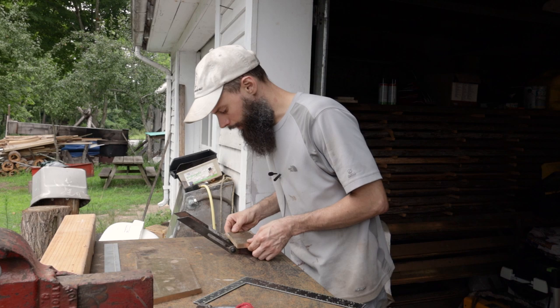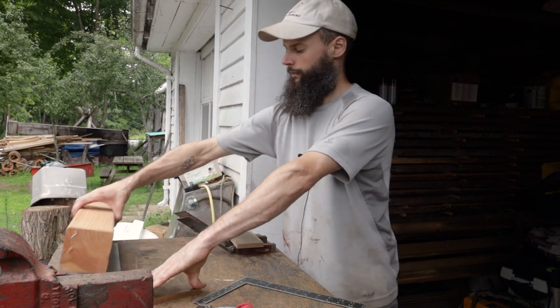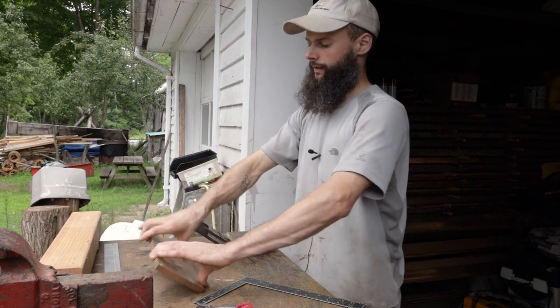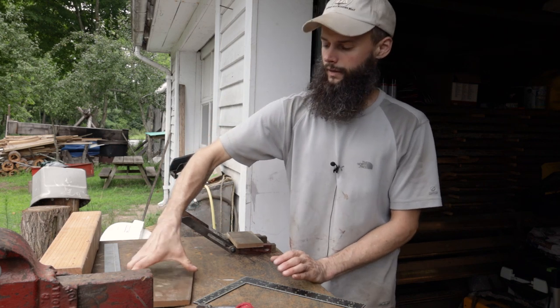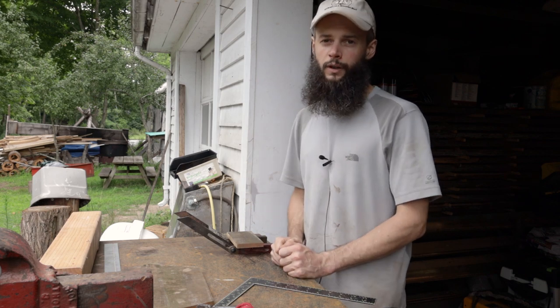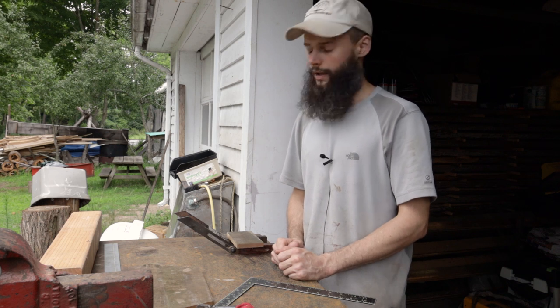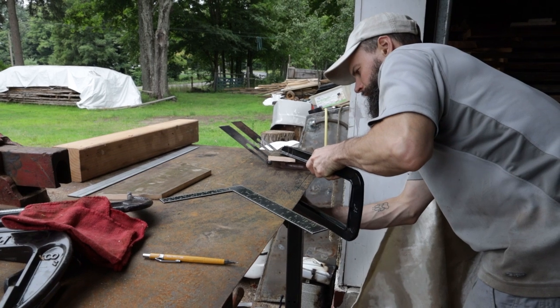You're going to get the base plate set on here and get this clamped down really well, and then we're going to put a block behind it, clamp that down really well, and then we can set this plate in and that'll hold it at the correct angle, and then I can fire up the welder and tack weld it and have everything be the right angle, and that way we don't have to drag the welder into the boathouse to do the tacks. We can just pick up the angles off of these. So I get that set up and we'll weld this puppy together.